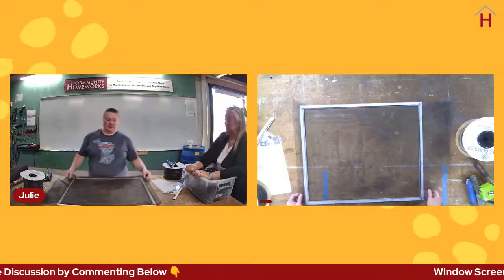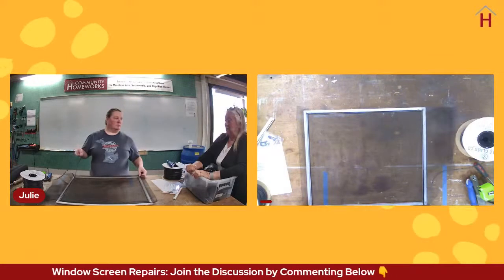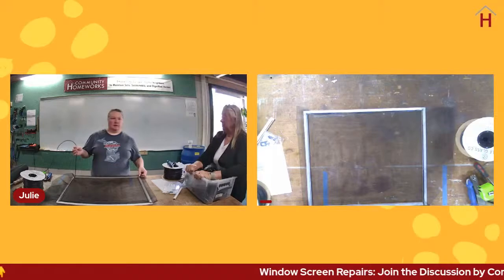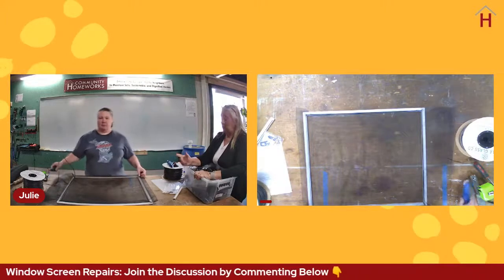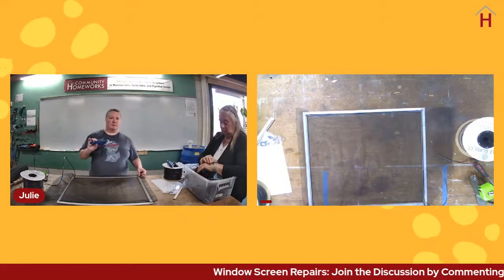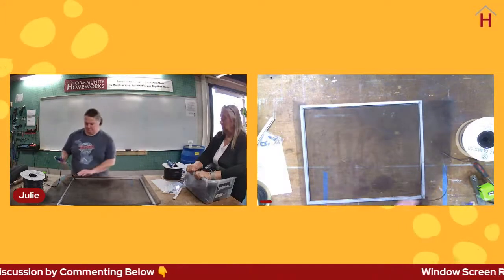To do it yourself, you've got $3 into 3 feet of screen, and you've got, even at most, $3 into spline, and that would be overestimating the spline. You've got much less than that. You've got less than $1.50 into spline. So you've got $4.50 total spent on your materials. And then if you buy this tool, that might be another $4. So you're under $10, and now you can fix this screen, but you also have the tool handy to fix other screens. So the next screen would only cost you a little bit less than that. So you could probably fix it yourself for roughly half price.